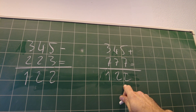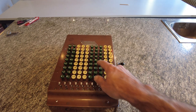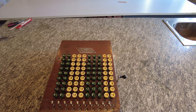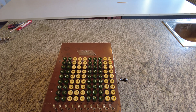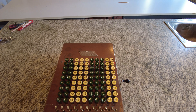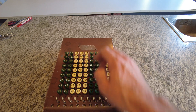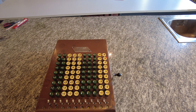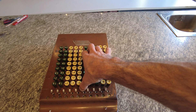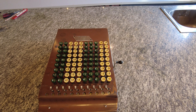It seems a little bit complicated but if you practice a little bit you will get to do it quite quickly. The Comptometer helps us because very close to each number there is a very small number which is already the complement. So if I have to subtract 222, I watch these small numbers and then press the corresponding complement digits. I obtain 1, 1, 2, 2 — which is actually too big because we should take away the carry one. What the calculator allows you to do is push this little lever with one hand while you push the number to be subtracted, and in this way you get the correct result because the carry mechanism is blocked by pushing this little lever.